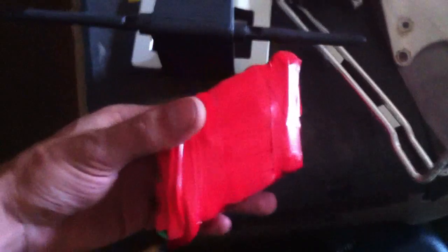Here's that Konion — or Sony — 18650 pack: five in series, four in parallel. This gives me — these ones claim to be 1.8Ah, the GRs — so that's 7.2 amp hours.